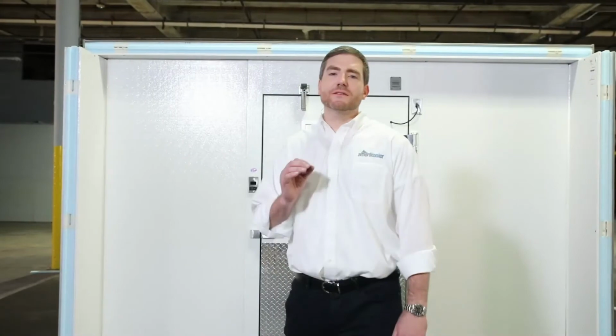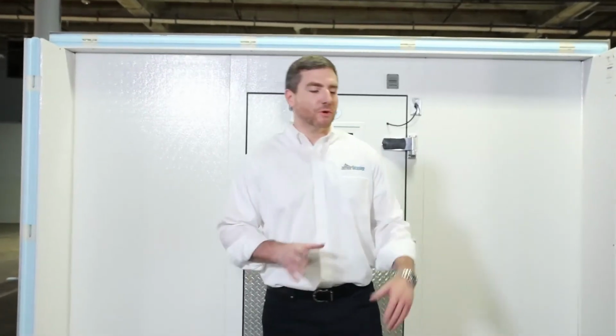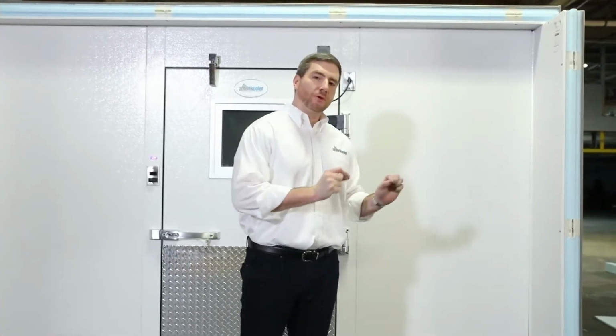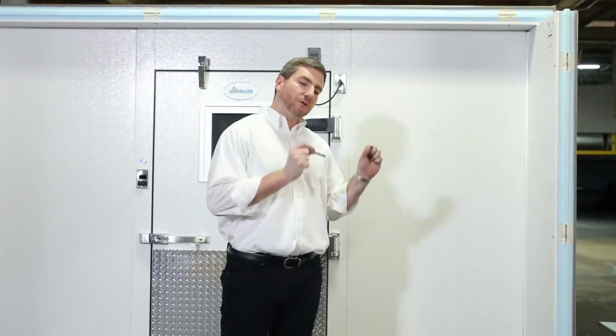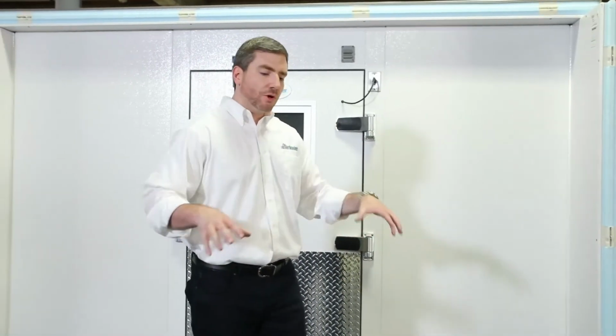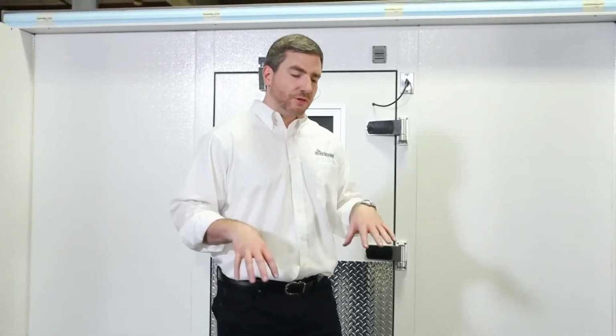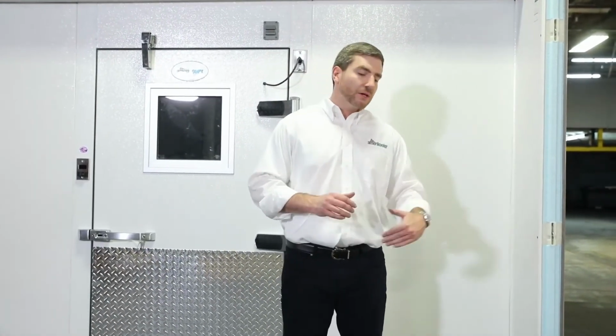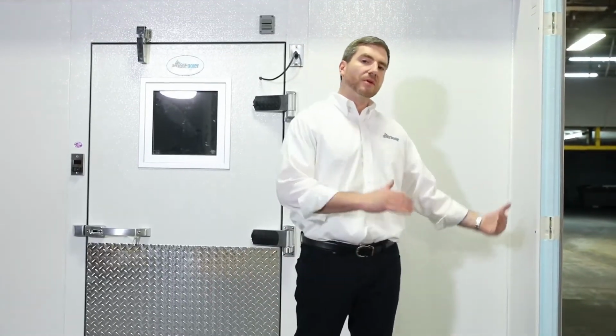All right, guys, we're getting into a very important part of the installation, which is where we're laying down what we call the vinyl screed for the no floor section of the walk-in. So it's a cooler freezer combo. We're getting into the cooler portion that has no panel floors. So the walls are gonna go directly on the floor, but they're gonna go on this vinyl screed, right? The vinyl screed is important because it has an NSF, National Sanitation Foundation, cove. So it's important that we lay that down before we put the walls.